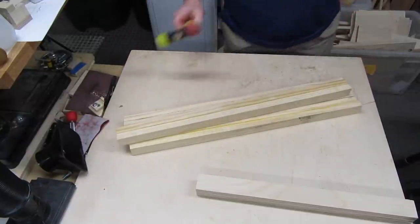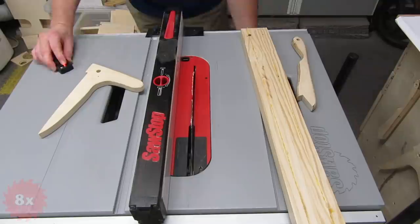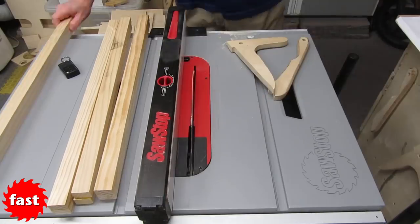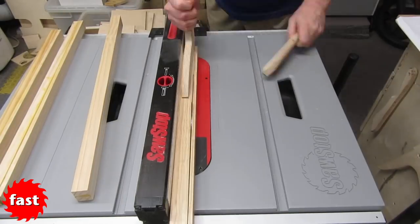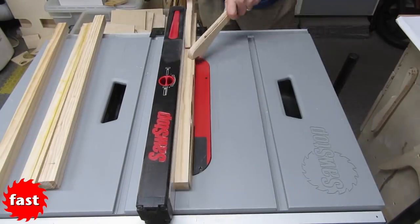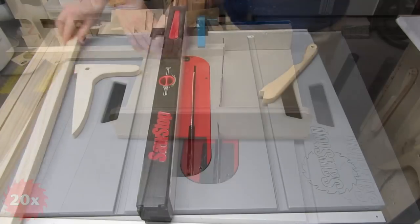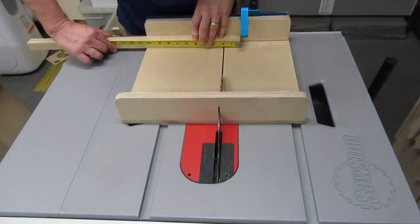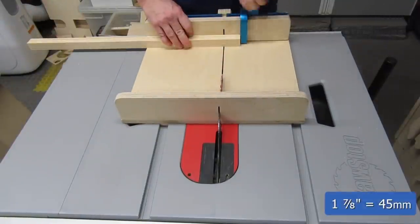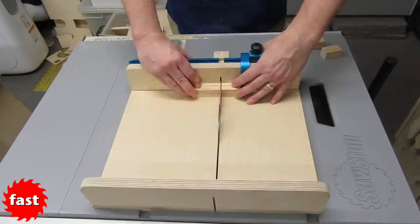Fortunately, these sections are much larger than I need, so I can just cut them apart on the table saw. After separating those pieces, I'm trimming all the laminated pieces down to 1 inch square. My plan was to leave the seam right in the middle, but I miscalculated, so the seam's off to one side — fortunately it ended up looking fine in the end. I'm trimming the ends so they're nice and flush, then cutting blanks of about 2 inches — more like around 1 and 7⁄8 of an inch to account for the kerf. I'm making about 50 of them this time through.